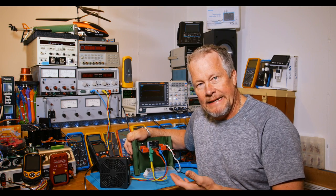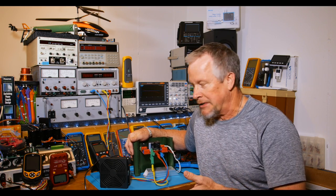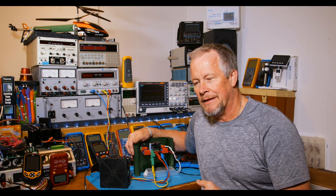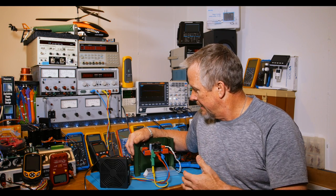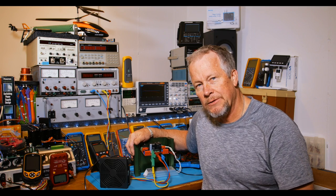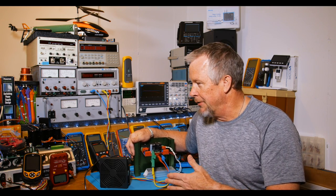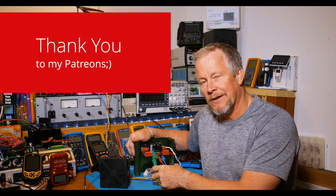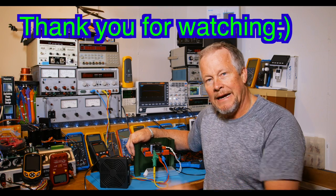This amp is pretty impressive. At 68 watts it didn't get excessively hot, though I didn't use thermal grease and the mounting isn't ideal — it'll get hotter with proper load testing. Next video we'll test with music power and discuss that further. The frequency response is very flat and the distortion looks really flat across the frequency range too. This amp might become my benchmark to compare others against — I've got that big amp I haven't properly tested yet, and it'd be interesting to run them head to head.